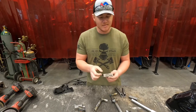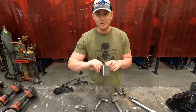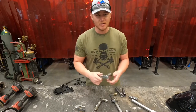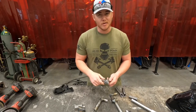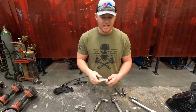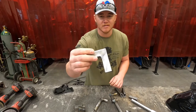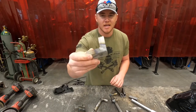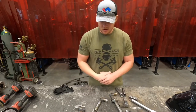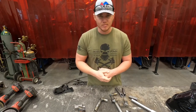This stuff is a lot thinner than what you've been welding on. You've been welding on like 3/16ths plate and up. The tubing we generally do our projects with is like 0.083 — 83 thousandths thick — all the way up to maybe 0.125, which is eighth inch thick. I'll take it all the way through to where you can do the nice finish work, how to properly do a weld, how to set up things correctly. These are fun little welding assignments and good practice before you jump on to your fabrication project.